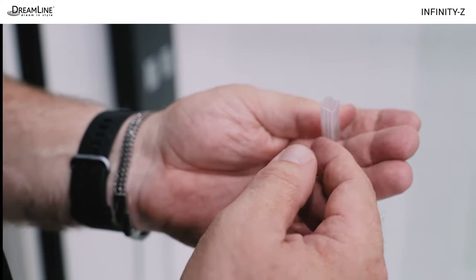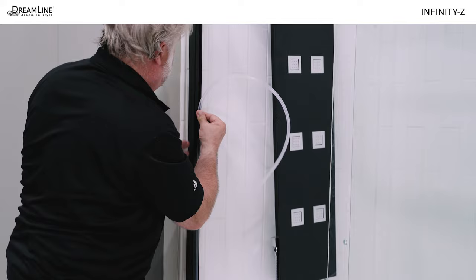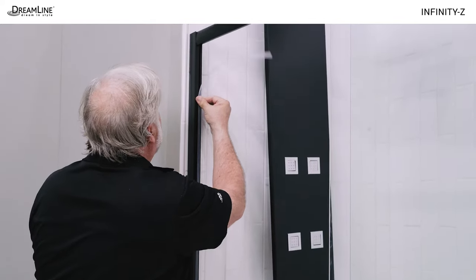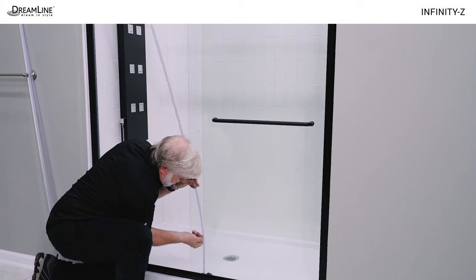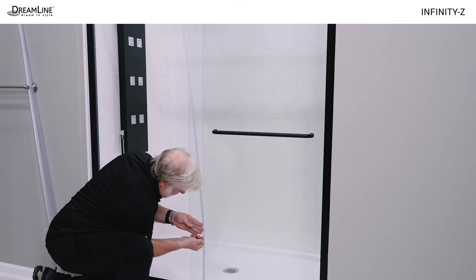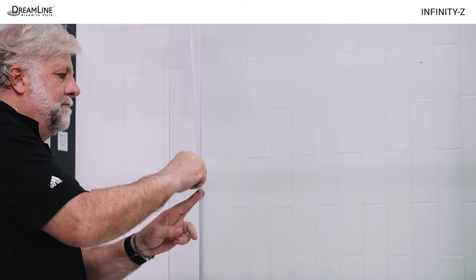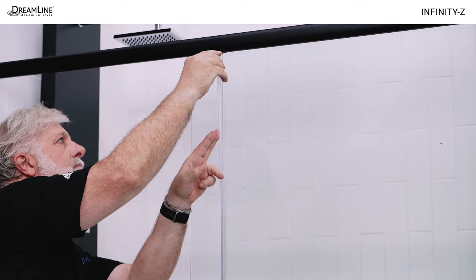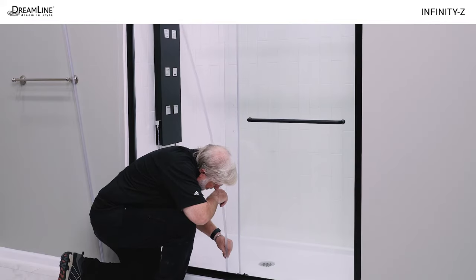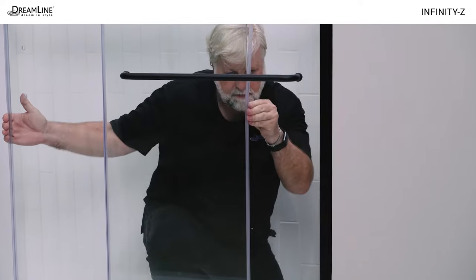Install the square-shaped insert vinyl with the flat side facing out in the glass profile on the door side of the shower. Install the vinyl seals next: the shorter vinyl is installed on the exposed edge of the panel glass with the soft fin pointing inward toward the door glass. The two longer vinyl seals attach to both sides of the door glass with the fins pointing toward the outside of the shower.